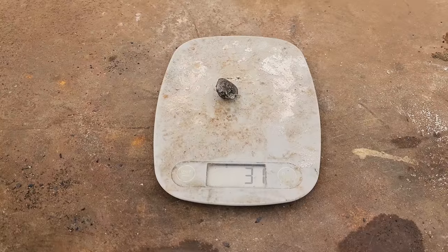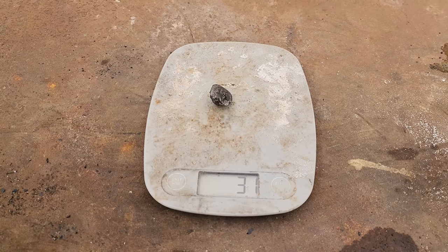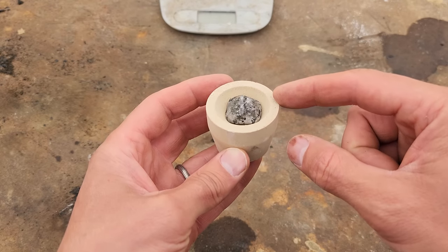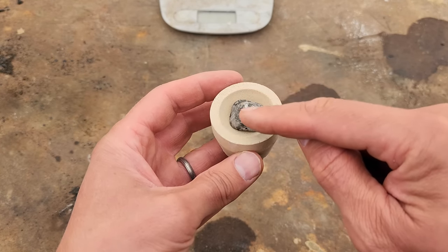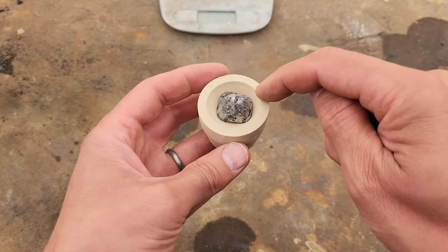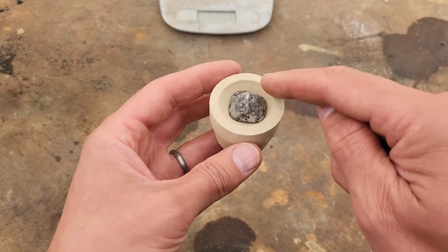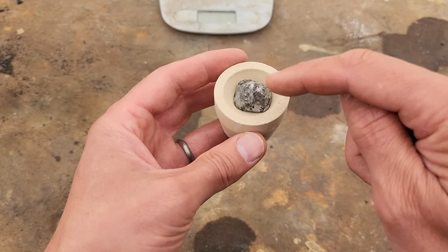All cleaned up, it weighs 31 grams — so we didn't lose hardly any collector metal to the reactions going on in the crucible, which works out good. Now we'll take that and get it in a cupel. This is a cupel — however you pronounce it — and we're going to put our bismuth bead in there, put it in the electric furnace and get it up to about 1800 degrees Fahrenheit. That will melt the bismuth, and it will melt the bismuth oxide that forms on the surface of our little molten puddle. The molten bismuth oxide is going to roll over, and when it touches this cupel it absorbs into it like a sponge. The precious metals don't absorb into the cupel, so as that reaction continues the oxides continuously roll off and are absorbed into our metal oxide sponge — our cupel — and the bead gets smaller and smaller until there's no more base metals left and you're only left with the precious metals.